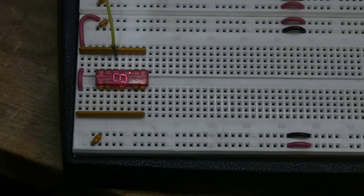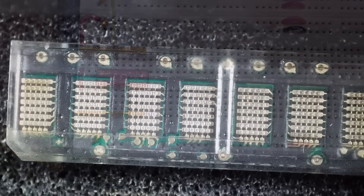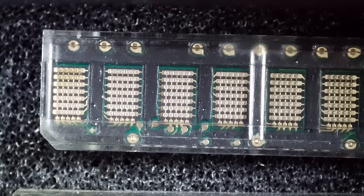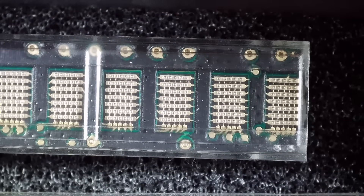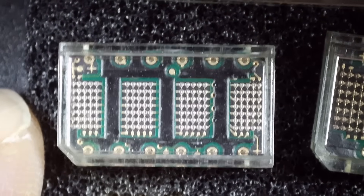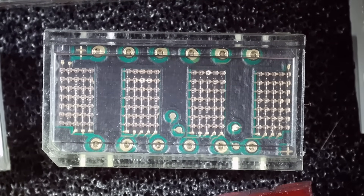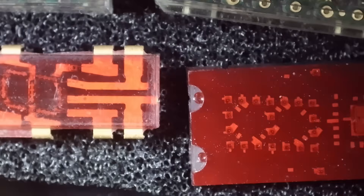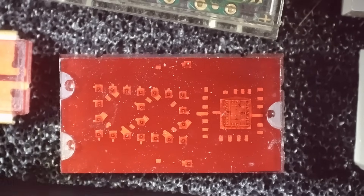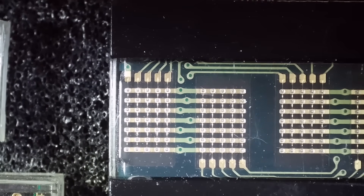I'm kind of jaded — I was at HP Optoelectronics Group and I didn't really pay attention to much of the competitors. I'll just leave you here with some microscope work. We can look at some of these parts; they're pretty nice under the microscope. You can see how much work there would have been to bond all of these and what type of failure rate — you had to get them all right. If one's bad, you have to throw the whole thing away. So you've got to make sure your wire bonder is in good shape. Alright — chip of the day: some HDSP-type devices.